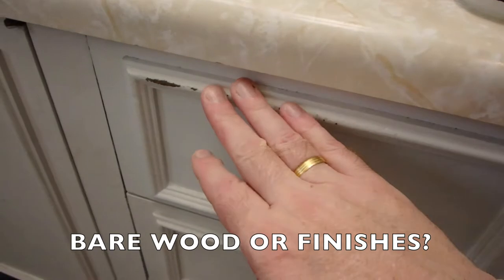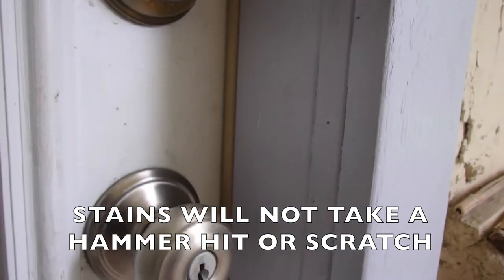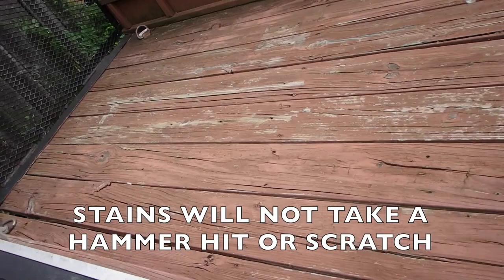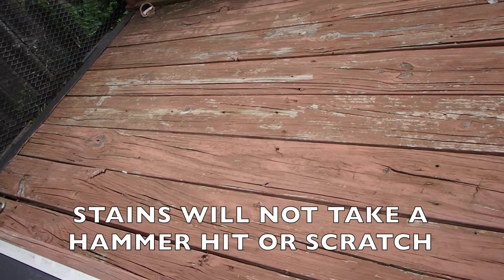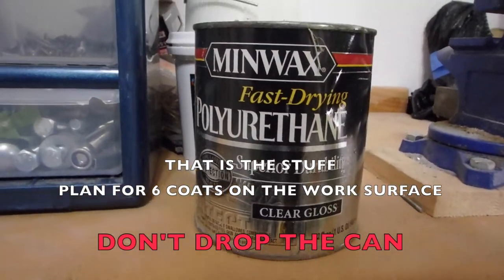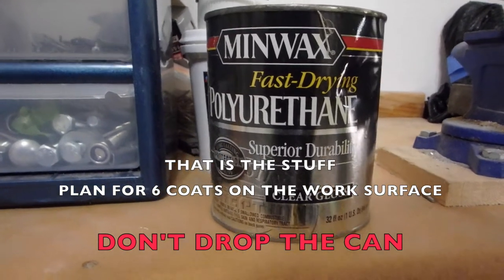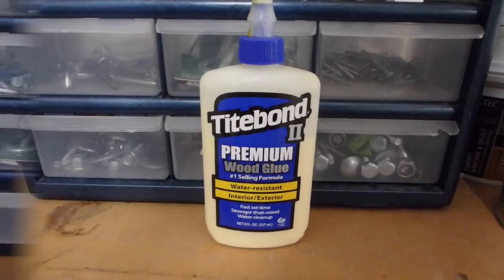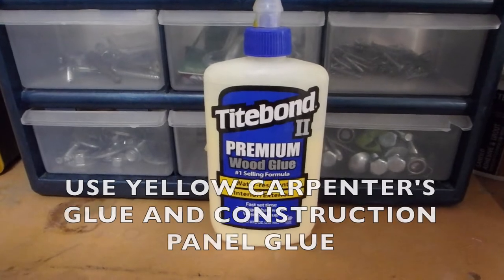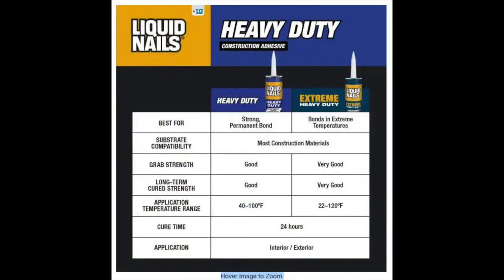I looked into different kinds of treatments and coatings. To be honest, a lot of the stains are not 100% weatherproof — they will degrade over time. The one thing I was 100% sure would never degrade is polyurethane. For the legs, I did use some construction glue as well as yellow wood glue. Once it dried, I knew it was never going to come apart.